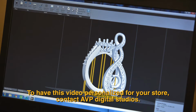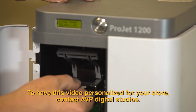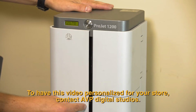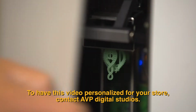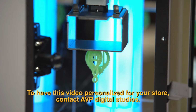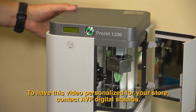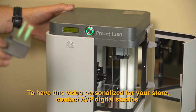Once you've signed off on the design, the next step is to create a wax model of the piece. For this project, we are growing the wax in a state-of-the-art 3D printer. The printer builds the wax layer by layer, perfectly replicating all the detail of the CAD design in the precise dimensions. The models can also be cut using a computer-controlled lathe or even painstakingly crafted by hand.